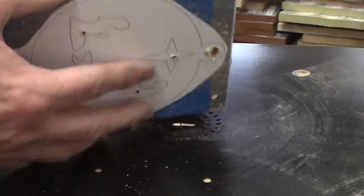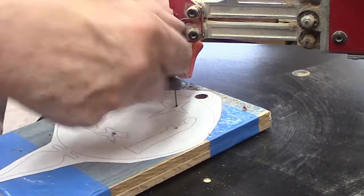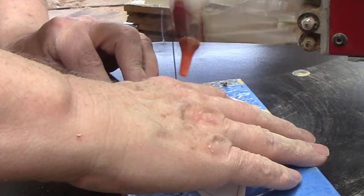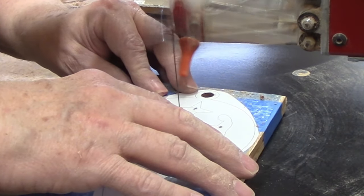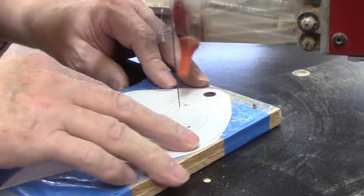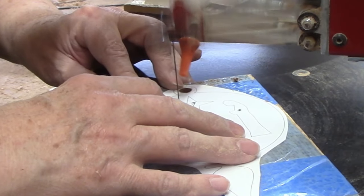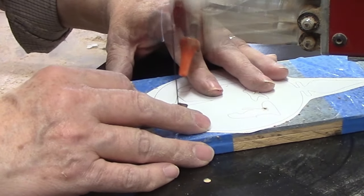I have a number five Pegas modified geometry blade in the saw — that size will be fine for a stack of two nativity scene ornaments. I determine blade size by taking into consideration the thickness of the wood, the hardness of the wood, and the complexity of the pattern I'm cutting. I left a link to my video on that subject on screen and in the description.